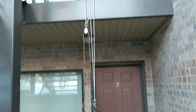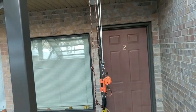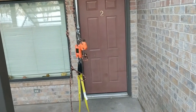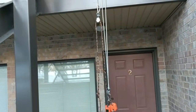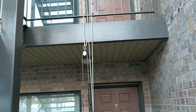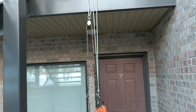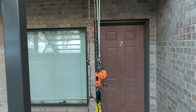That should multiply to give us a four, plus that one that's going back into the catch. If I were to suspend myself from the load and also be the one pulling, the frame of reference changes and the white rope system becomes a three-to-one. So in that case, when I'm hanging from it and pulling on it, we've got a seven-to-one system — you multiply two by three and then add the one.